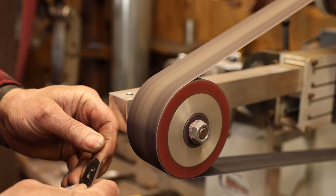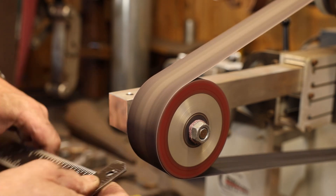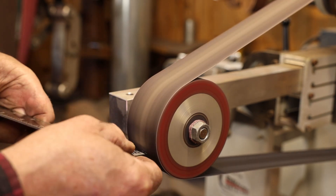Cutting with a band saw generally leaves a little burr, so I take it out to the grinder with about a 220 belt and just go ahead and clean that off real quick.